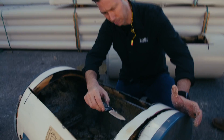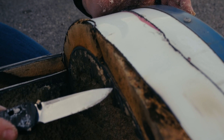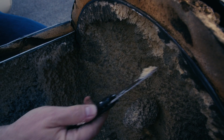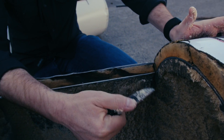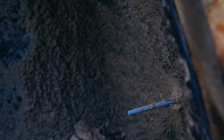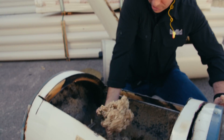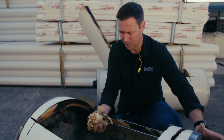Let's put the knife right here on the top. This is the metal wall, and this is the scale forming right here. On this tank we've got maybe two inches — inch and a half — of scale formed right at the top of the tank. Oh my gosh, that's incredible. Just look at the massive amounts of it all in the tank. That is gross to think that that's your hot water.